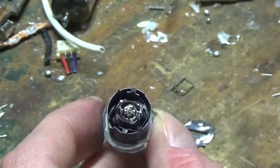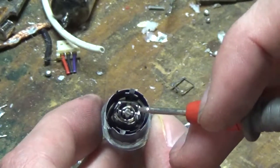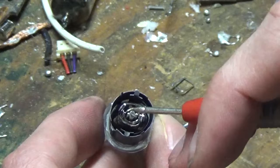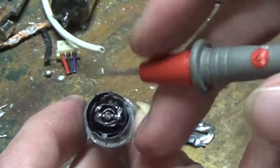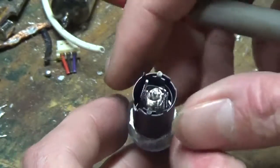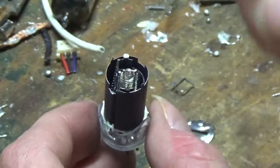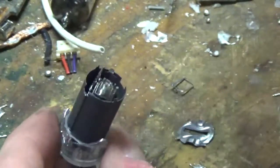You put a negative bias, a negative charge on your control grid with a signal in that frequency, and when you have the signal going, the electrons flow through it at a higher rate within that frequency range to the plate, which then shoot out the plate, go into another tube, get amplified there, processed there, and so on and so forth, to eventually it reaches your output stage or your video stage or whatever it is the device is. In this case, these are radio tubes and a stereo vacuum fluorescent. But any kind of vacuum tube system works the same way for the most part.